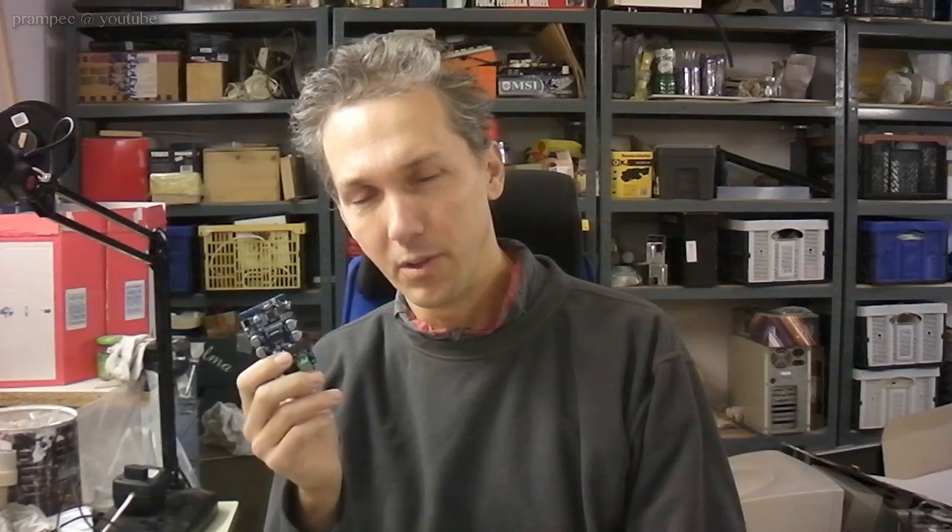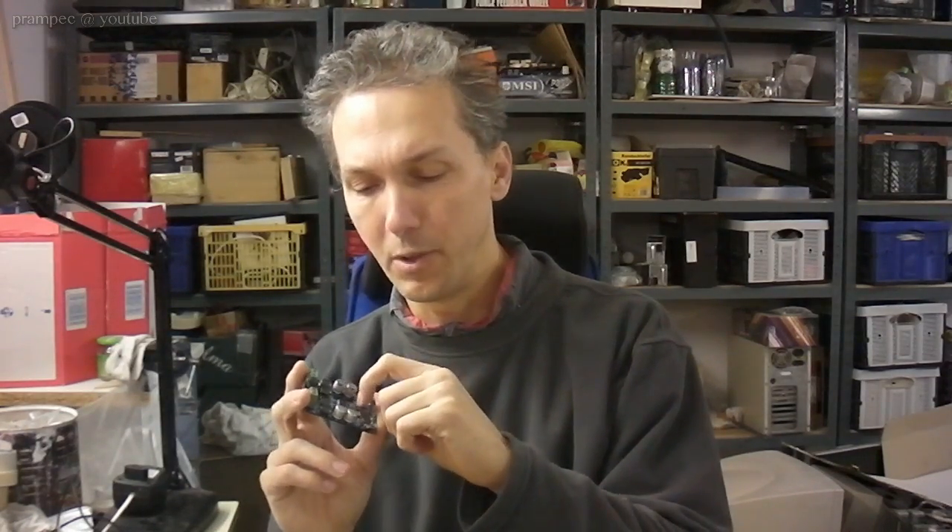As a conclusion, I can recommend this board if you don't mind some background noise, especially when the jumpers are removed as shown in the video. But if you don't care about background noise and just want to go loud, you don't really have to worry about the jumpers at all. You might also find products where the jumpers are not populated at all, or a switch is populated so you can switch to a lower amplification mode.